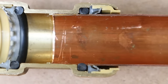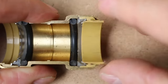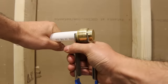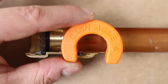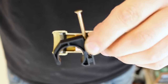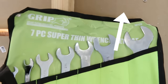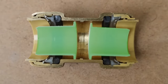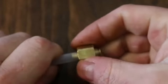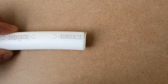Now let's go back to the first two components we set aside. This one is called the release collar, and its job is to deactivate the teeth to allow the fitting to be removed. There are several tools used to depress it: the dedicated disconnect tongs, the C-clip, and larger tools for bigger fittings. I also made a video on six ways to remove them without any of these for emergency situations — I'll leave a card and a link in the description. The last component is the pipe stiffener, similar to brass stiffeners used with compression fittings on PEX piping. SharkBite has one embedded inside the fitting when you purchase it.